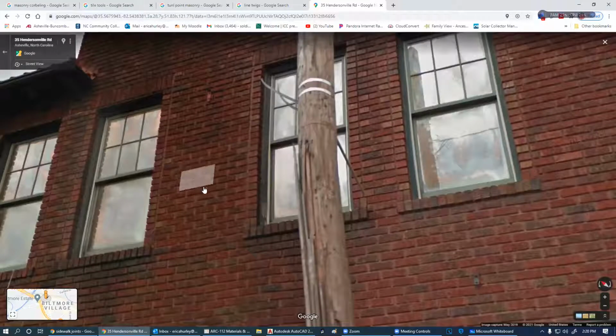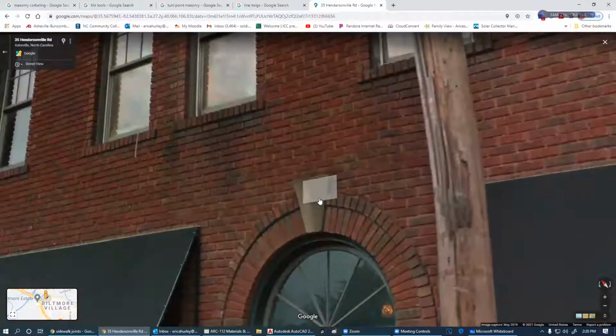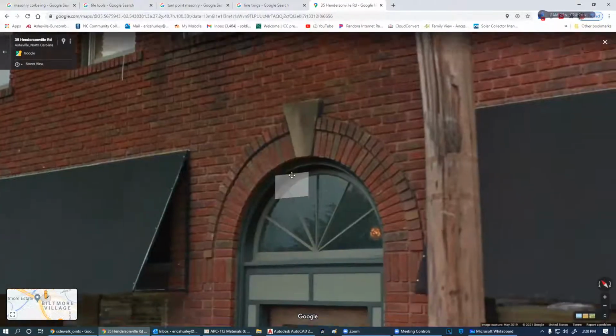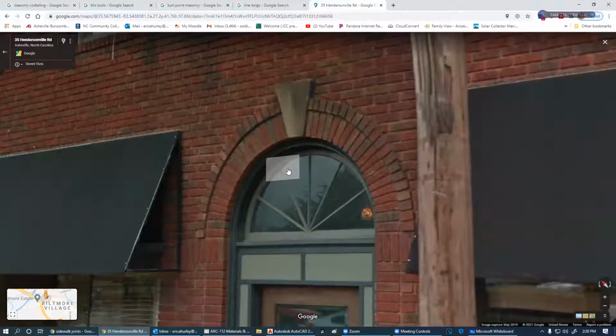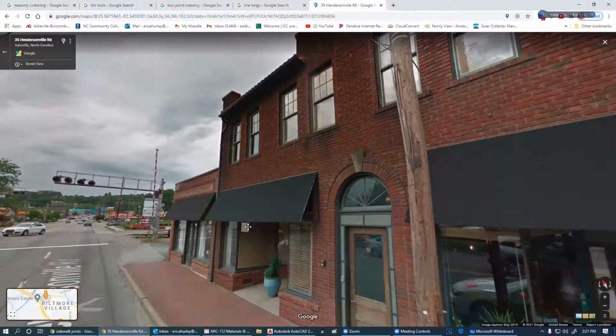You have soldiers, sailors, headers, all sorts of different little things. There is a keystone. So the keystone actually came about so we could stack this stuff in here dry, and that's what they did a lot of times. And then by putting a large keystone in here, the weight of this pushing down pushes against either side of this arch here and holds it all together. So basically what we could do is we get some sort of support here, put our dry stack up, put the keystone in. Once we put that keystone in, we can pull our support away and it's not going to fall.